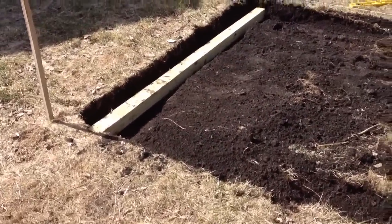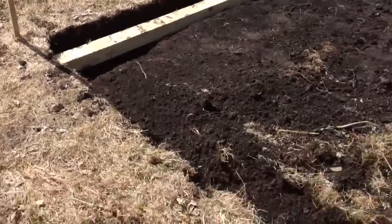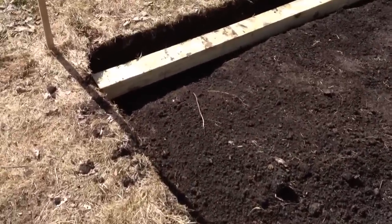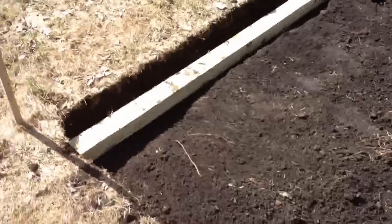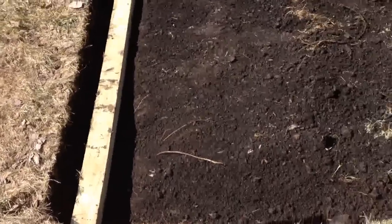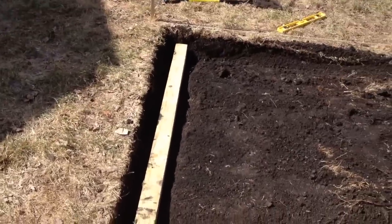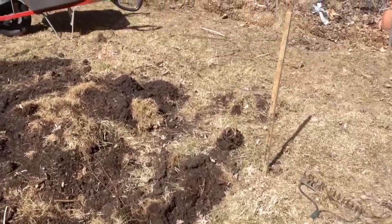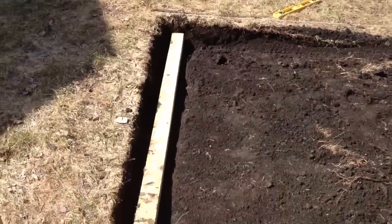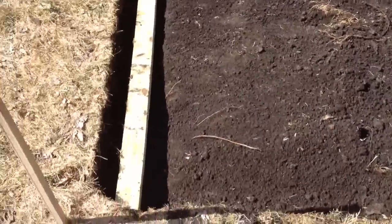Okay, so here's a little way through step one. I've started leveling this patch from the highest elevation — the upward slope. It's higher up here and it slopes away from the house. So I started clearing away the grass a little bit and then digging. Actually, first I staked out — this is going to be 8 foot by 8 foot. I staked out the square, and then I dug a little trench going all the way around, not very deep, just enough to break up the grass.